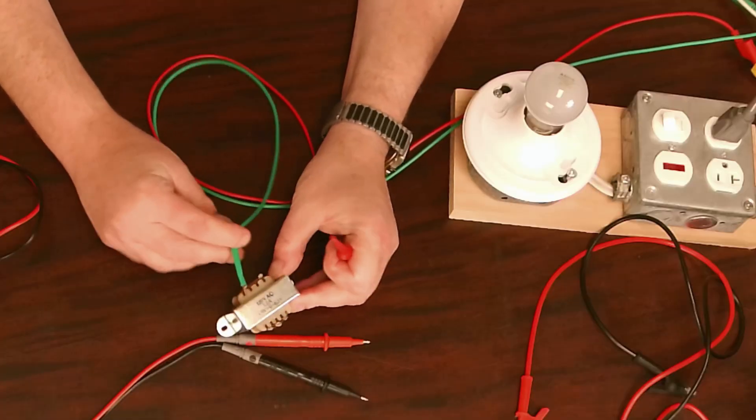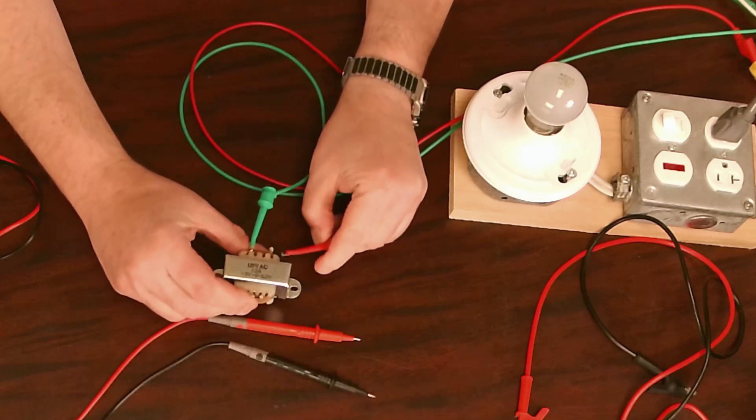At the same time, the light bulb will be protecting the secondary from an excessive amount of current. To that end, I have my dim bulb tester, which is really just a light bulb in series with an electrical outlet. I should note that when I'm doing all of this, I have the thing plugged into a GFCI — a ground fault circuit interrupter, or a residual current device depending on the part of the world you're in — to protect myself. And even at that, I have it turned off before I try and attach it to the transformer terminals.